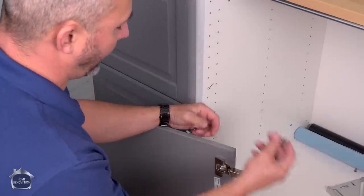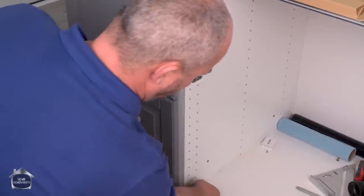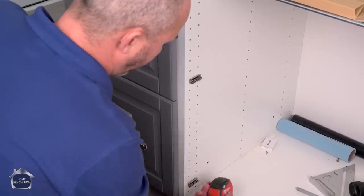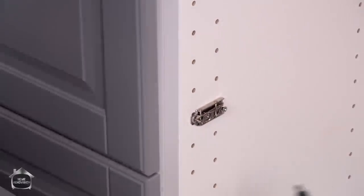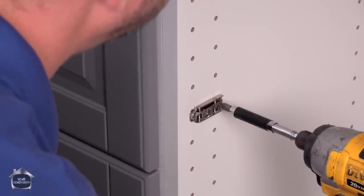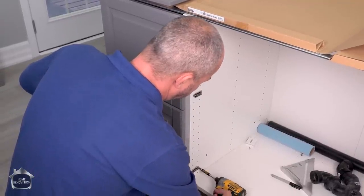This mounting hardware is really difficult to install if you attach it to the door hinge first. All right, just take it, push it in the holes. Grab yourself a soft mallet or a tape measure. All right, and then you screw in the screws. Be careful. Again, you're dealing with some plastic in the hardware, so you don't want to over-tighten this.